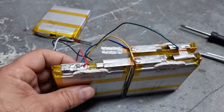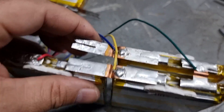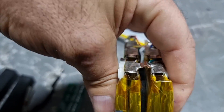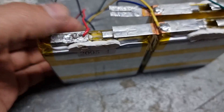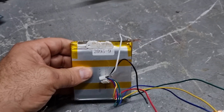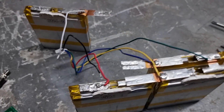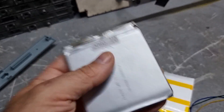As you can see, just one single cell — actually two cells connected in parallel — is the one giving us trouble. A chain is only as strong as its weakest link. We have four groups of cells, with two cells per group, and only one defective pair in the middle — that's it, the battery is done. But the good thing is they are serviceable: you can simply take it out, change the cell, and that's it.